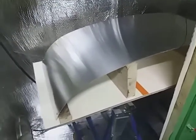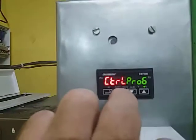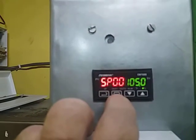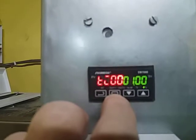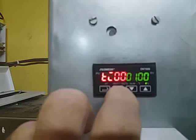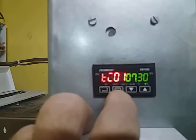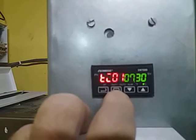The mold with the protective coating taken off of the aluminium is in the oven, and I have programmed the controller to go up to 105 degrees. We'll take it up slowly so we don't shock anything, then it's going to hold at 105 degrees for 7.5 hours, and we'll see how that goes.